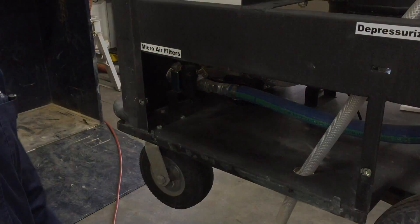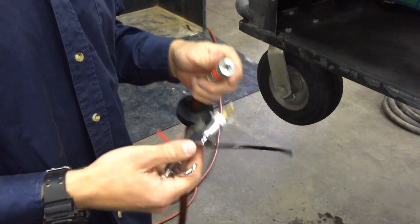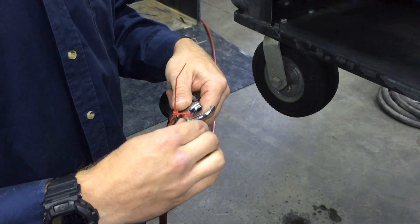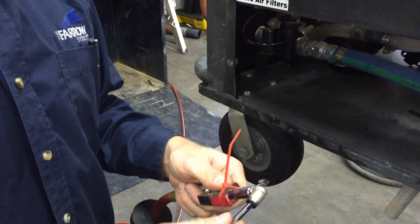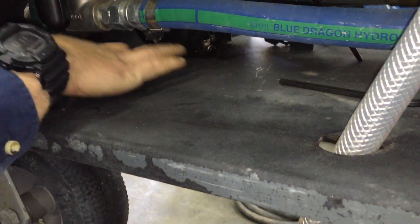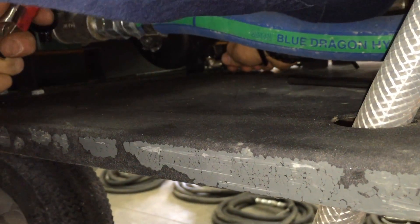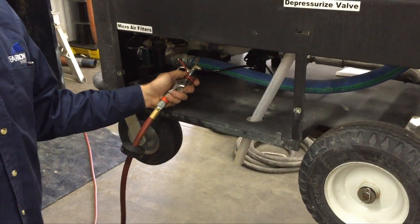This is the second method for opening up the diaphragm valve when changing the diaphragm. We have a standard air connection here for shop air — there's a 1/8-inch port. What I did was take one of those push fittings from the machine and screw that on there with 6mm line. This allows you to plug into the same port we used earlier on the diaphragm. Plug that in, turn on your shop air — again, this is to retract the spring so we can take the bolts off without the pressure of the spring.